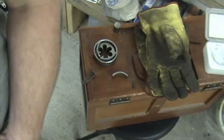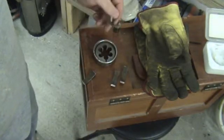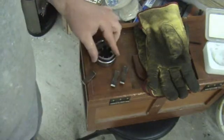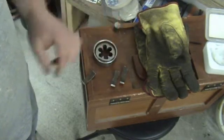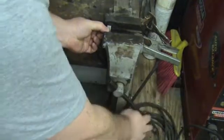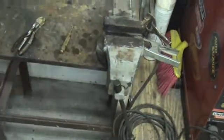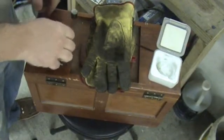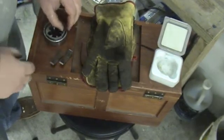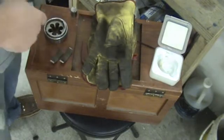So what I'm going to do is put them in the vise and give them a little squeeze. Once they're squeezed, they kind of fill up that gap. I'll be able to get a nice TIG weld all the way around that. So I'm just squeezing each one a little bit, not a lot, then fitting it back up. Yeah, that's pretty good — you can see it closed that gap. I'm going to do that for the rest of them and get them all filled in.